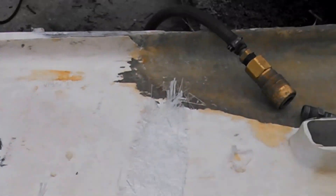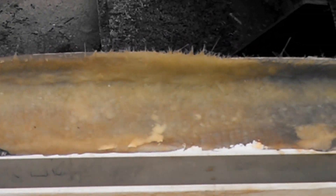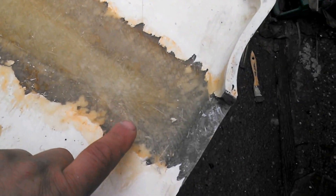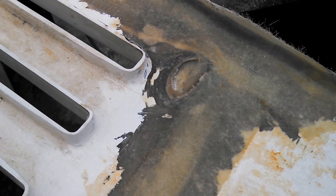Okay, so here it is after the resin has been poured in — the thickened epoxy. And we did the ones down here as well. So here's the repair; that was done yesterday and that's all cured up. Over here wasn't really a repair — it was just where the bracket goes to bed this in. There's a plug over here, and there's a plug down over here that I had filled in the same way prior to laying up the glass. The inside's done. We're going to let that cure, and then we're going to flip it over and work on the top side.